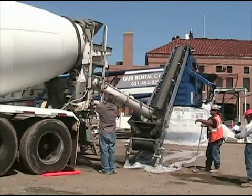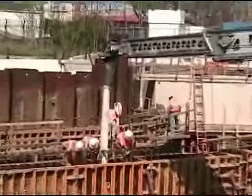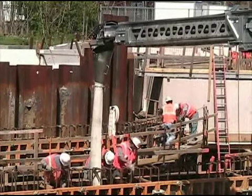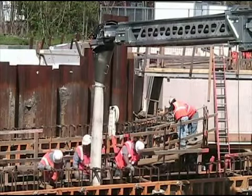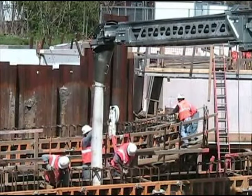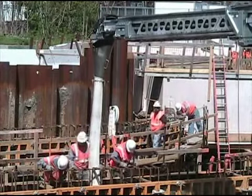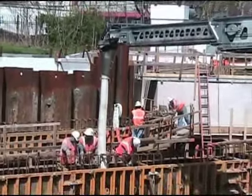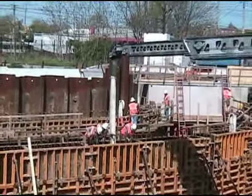It probably uses a conventional concrete mix. You don't have to use an especially rich mix that you would have to use with a pump. So there are many positives for a conveyor. It spots the concrete exactly where you want it. There's very little workforce here. Basically, they're just operating vibrators to compact the concrete.